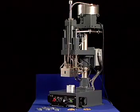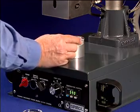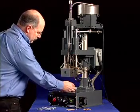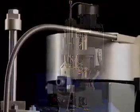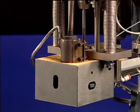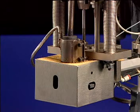To operate the Model HA machine, the operator loads the host part into a part holding device, the fixture, and activates the machine. The secret to this machine's significant advantage is in the method by which the insert is heated, due in part to the automatic delivery of the inserts to the orientation head. The inserts are preheated prior to installation, resulting in a much faster installation cycle.